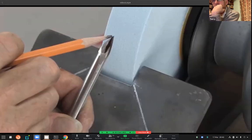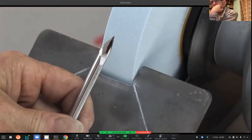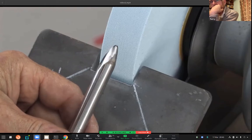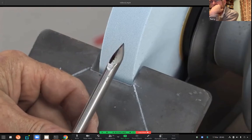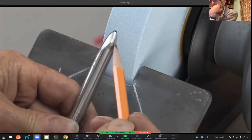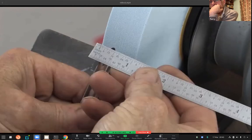The cutting bevel has been blackened for visibility. Its width at the tip is less than a 1/16 of an inch. The shape of the wing is straight or slightly convex. The sharp edge of the heel has been ground smooth. The shape at the very tip is an 1/8-inch semicircle.